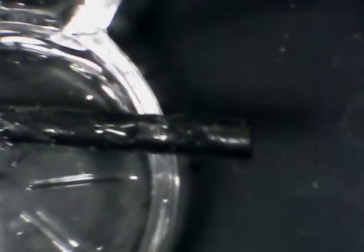This clear gel has been in the oven for about three hours. I took the graphite electrode — which had the graphite and manganese dioxide coating with the silicone paste — and dipped it cleanly into the gel bath, no crumbling. I also put some gel in a glass dish and with a paintbrush, with gloves on, went back over it and coated the electrode. That gel is already cooling and becoming more viscous, but it coats beautifully.